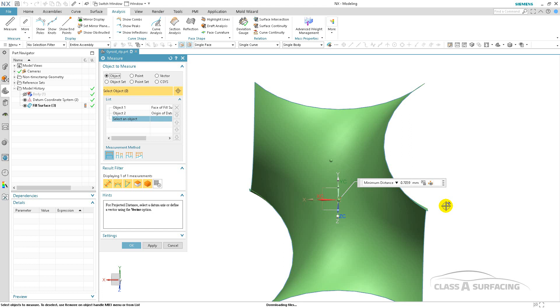That's what I meant earlier: the fill in CATIA did a better job of creating a surface that's truly balanced across that center point. That point is at the center of this model. I made a block starting at the center, 4 inches in all directions — 2 inches off of that center in each direction, so a total of 4 inches. Then I drew those arcs on those faces, did a fill surface, and then I just took those curves and arcs off of the CATIA model as well as the surface, brought it into NX, did the fill, and did that comparison.